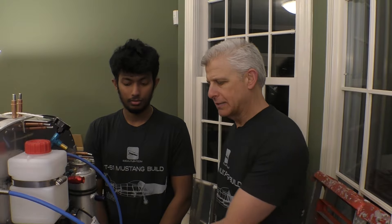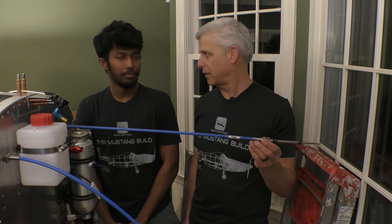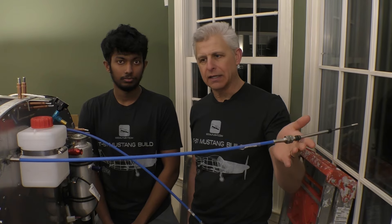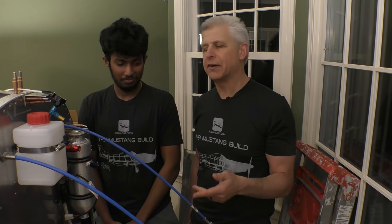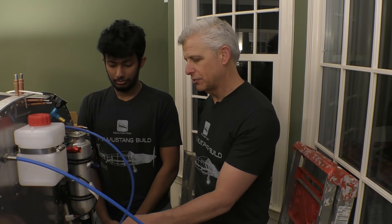The other thing we spent a lot of time on here were our control cables from McFarland for our engine. On this side is for our prop governor, and on the other side, throttle. These had to be sized exactly right to fit what those mounting points are going to be on the engine, and it really worked out well. I want to give a shout out to John Cowan, Chris Simon, and Randy Williams who actually built these cables. They did a fantastic job and we would not have been able to make all of this work without that. The Titan design has solid rods, which work well especially if you're using the LS3, but in our case using the L33 engine, we really want the flexibility of using these cables.